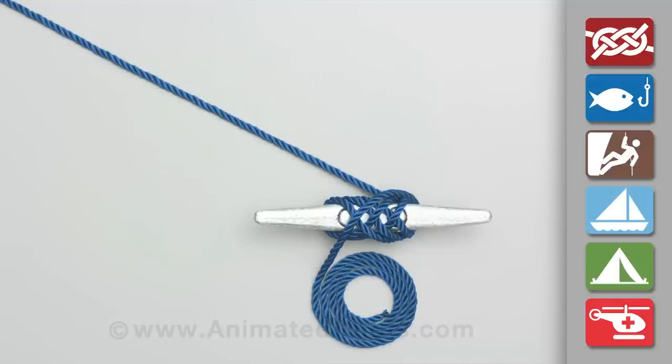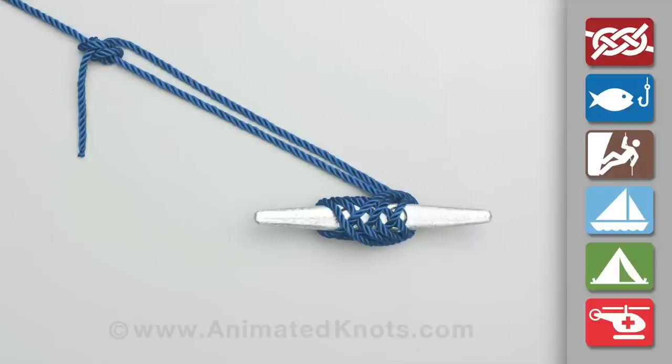Spare, unused rope is often coiled as a Flemish flake. However, this collects dirt and leaves a spiral stain on the deck. A better solution is to tie the tail back to the standing end using a rolling hitch. This is secure and keeps the deck clear.